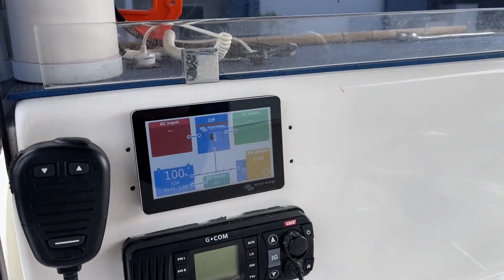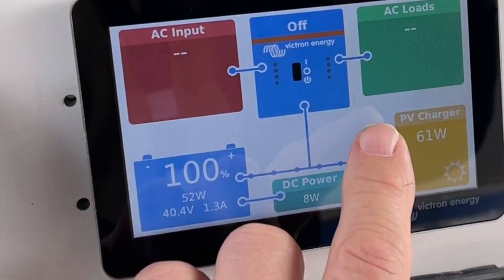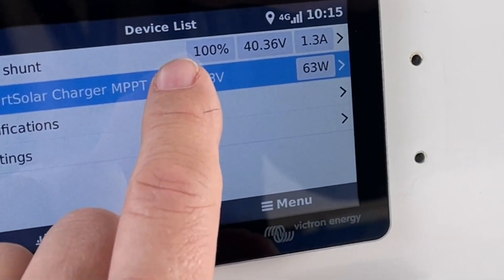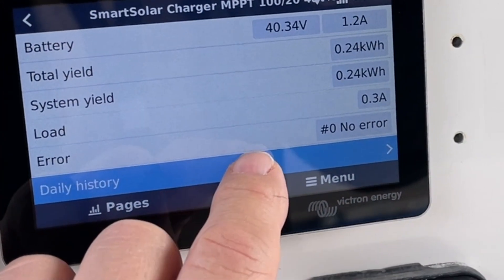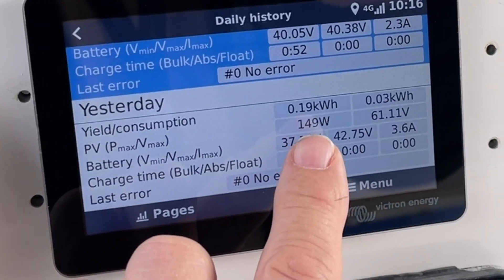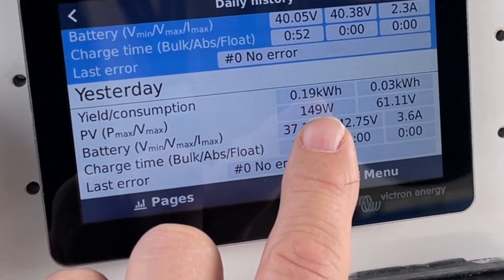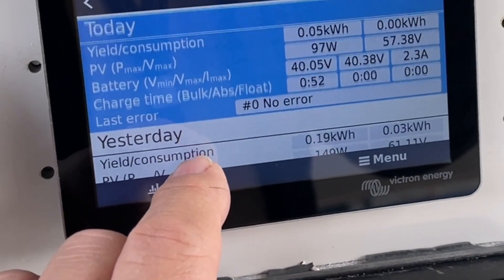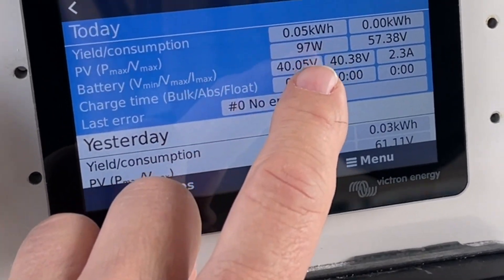Just have a look now — we've got the screen running up here, we've got solar at 61 watts coming in. It's low in the sky and cloudy today, pretty average. But yesterday we did 149 watts off two 140 watt panels — pretty pleased with that. 55% is about the best yield you get here in the winter. Today we've done 97 so far.